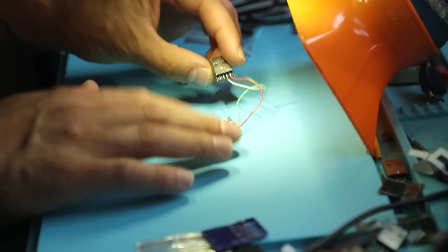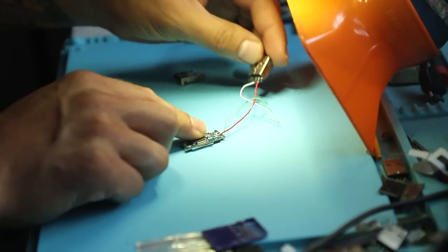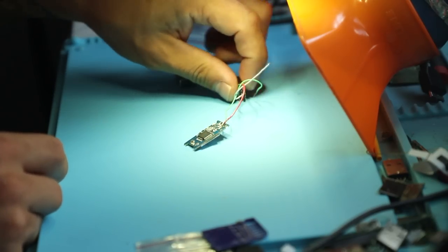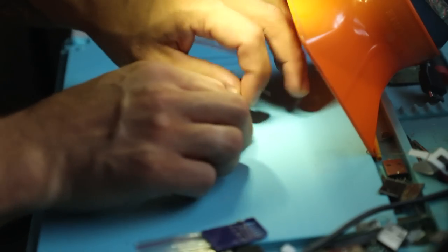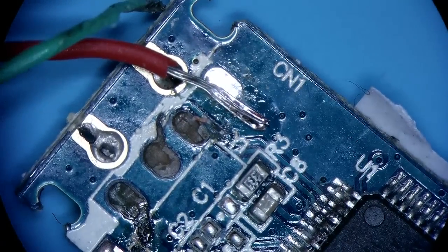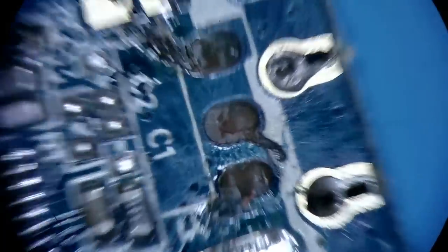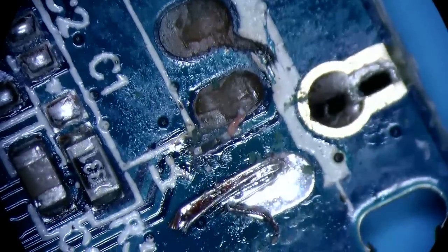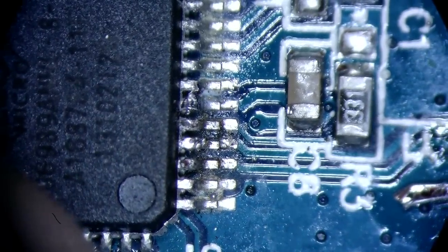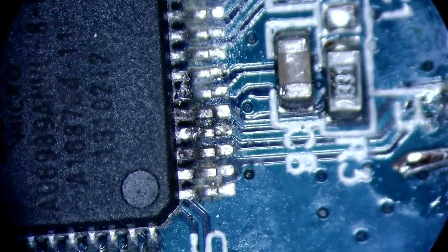All right, looks like somebody put these wires to link damaged pads to already damaged connector part. But first, let me have a look at the solder job that was performed here. So first things first, we need to inspect the traces, right? I'm also worried about this stuff right here. That's not supposed to be jumped, but it is jumped. So we got some work to do, guys.